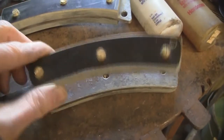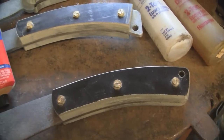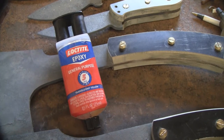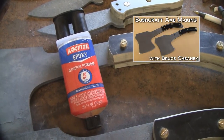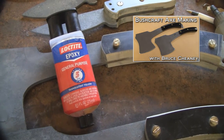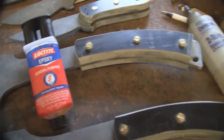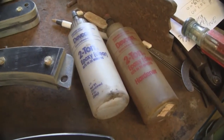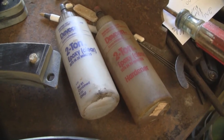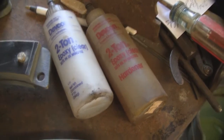I'm doing the pre-fit like that, and I've got that where it bolts right on. If you're confident with the way you've got your handles prepared to glue on, you can use the five-minute epoxy — it sets in about five minutes, and that's about all the working time you've got to get those pulled down good. If not, consider the two-ton epoxy. You've got about 30 minutes working time with it, and then within two hours you can kind of work with it, and in eight hours it's a complete bond.